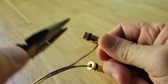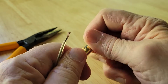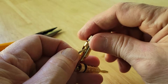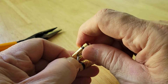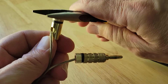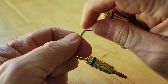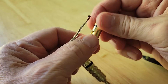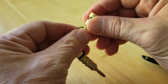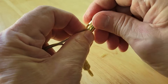Once again I'm going to take my long nose plier and give it an extra twist so it's tight. Pull it — if it comes out, it's loose and you didn't tighten it down enough. That's why you should test, because you're compressing the wire strands and you need to really tighten this down so it doesn't slip out. Make sure the wire stays down the middle and doesn't go off to the side.